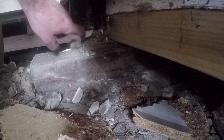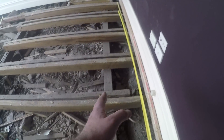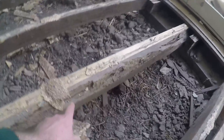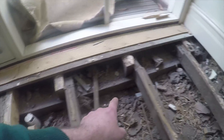Strip footing runs all the way through. Look at this one — this is red gum here, and this here is the stud. It's almost completely rotted through — it's sitting straight on top of the brick so there's no moisture barrier at all between those two. It's been touched up before; I can tell that because there's a secondary bearer put in away from the wall and it's picking up the ends of all of these joists. But these joists are all being replaced. You can see these are all fairly new — probably about 30 years old. Here we've got signs of borer running through the timber and signs of termites also running through this timber. That's red gum sitting on top of the bluestone.